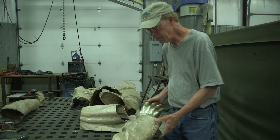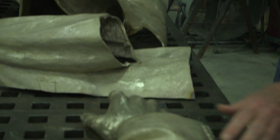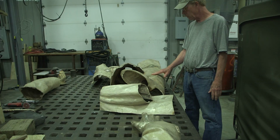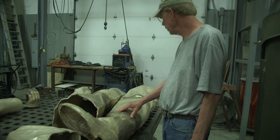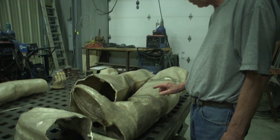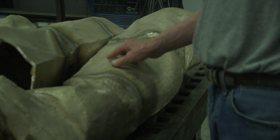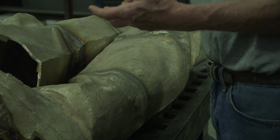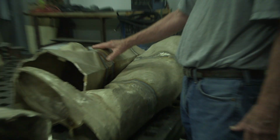Yeah. I love it. So the legs are being assembled, and it's several stages to finish out the welds. They're welded together, ground to the top level, and then special tooling is made up to cut the grooves from the clay tools to continue through the weld lines. That's key to making them disappear, and not just shape, but texture as well.